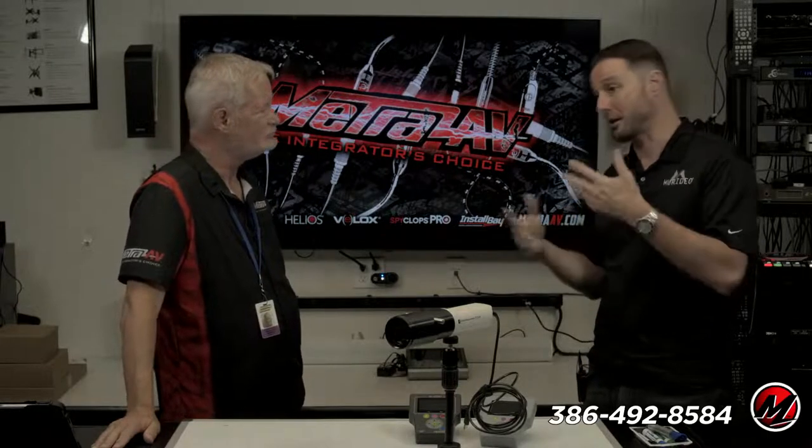It's great for living in the everyday world. It's dynamics, the same as audio. That dynamic range is what our eyes and our brains like the most, and the more the better. So when you have these really high luminance LCD panels, whether they're LED backlit or quantum dot backlit or some sort of hybrid, we're getting that brightness, but with good control of the local zones, or if it's an OLED and black actually is black, that gives us a really low black level.